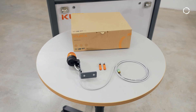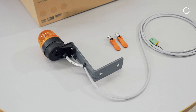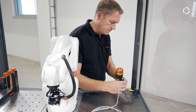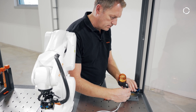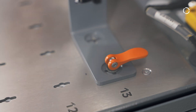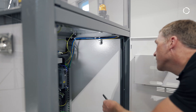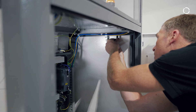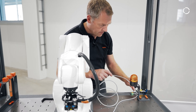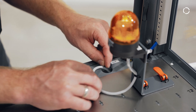The option Drives Ready Lamp comes in an extra box. It contains the lamp with a connection cable and two quick fasteners. The lamp itself is mounted on the application plate with quick fasteners. Please remove the cover of the cable slot in the right back corner, then insert the cable into the slot, guide it to the controller and connect it.